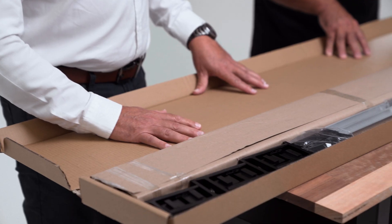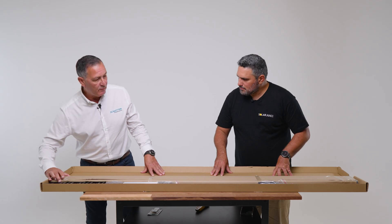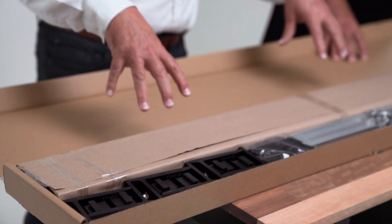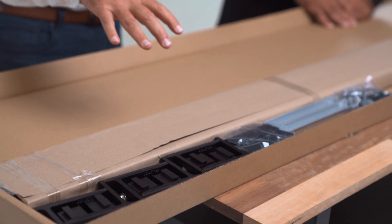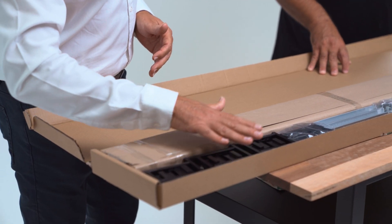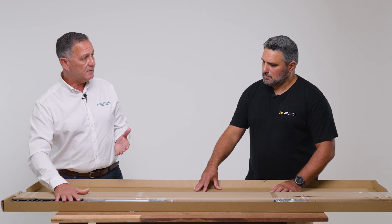In every one of our three-panel tin kits you'll notice a section of rail here which is 1.8 metres long. You can actually fit this box in the back of your ute or into your van, so if you're doing a 21-module install you're going to grab seven of these boxes and off and away you go. Apart from the rail, we have our black anodised L-feet, which we call a Rapid SML.